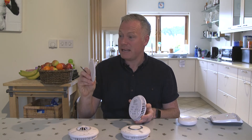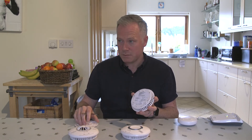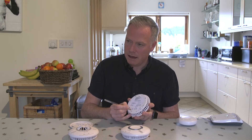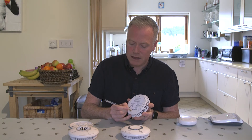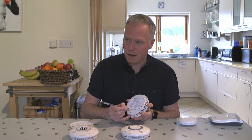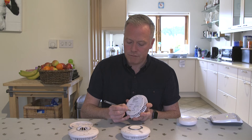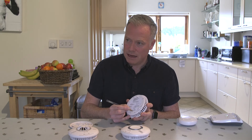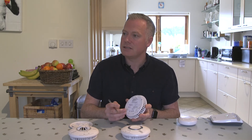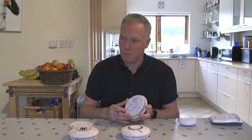So what I do — I take the base plate off the alarm to get access to the wireless module. I get my pen onto the pressure pad here. What I will be doing is pressing the pressure pad softly and out again, just pivoting my pen in effect. So press, let go, press — and I will hold it on the second press for as long as that red light here stays solid. Once that red light goes out, I will remove the pen and you will see a series of flashes to say that that alarm has been removed from the network.